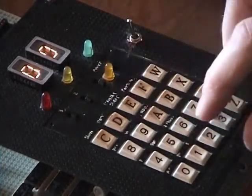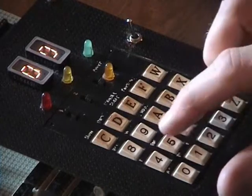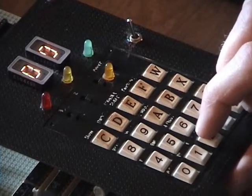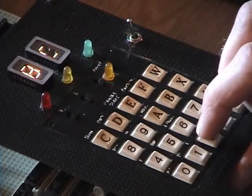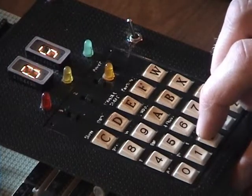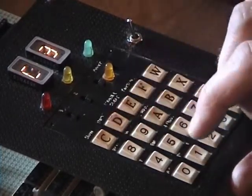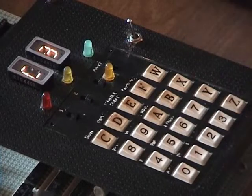And I always throw a couple of stops in here, just for fun. Now let's see if, oops, guess I messed that up. Accidentally wrote a 0, 0 in my first location. Okay, C3, 0, 0, 0, 0, 82, 20, 3D, 09, wait a minute, 0, 0, let's see, 0. Okay, so this is all set up now. It's going to take bytes in with the serial port and dump them in starting at location 0020 until I stop the program manually.